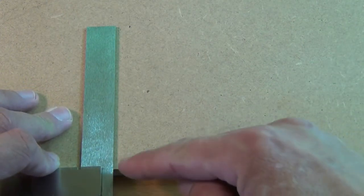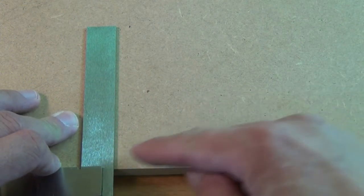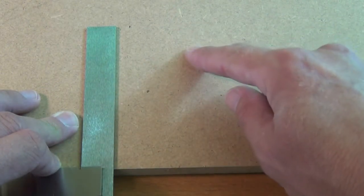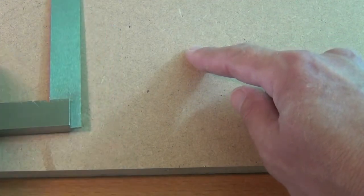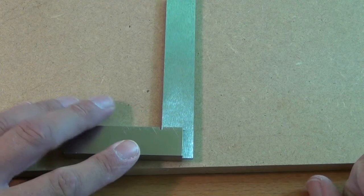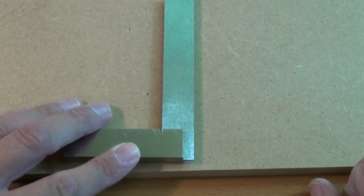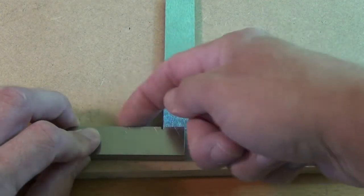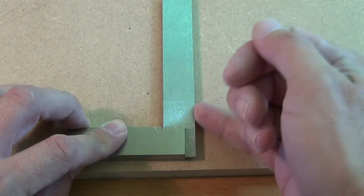So that's measured a 90 degree angle like so and like so, which equates to 180 degrees, or the straight edge that we measured on this edge of the board. So that's proved that our tri-square is actually set at 90 degrees. But that's 90 degrees from the inside of the stock to the outside of the blade.